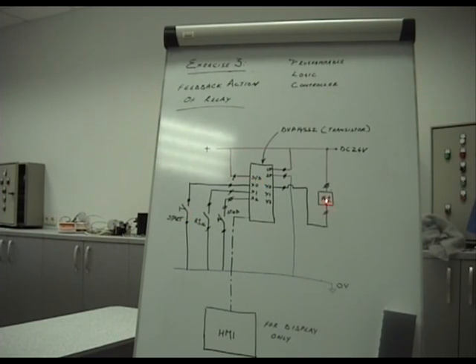This is a hold-on feedback system used when PLCs drive main contacts of pumps and starter panels. The start button comes on, drives this relay, and feedback from this relay confirms the relay has actually been given the start command. If feedback is not seen, it stops the relay. To stop it, you need another push button.